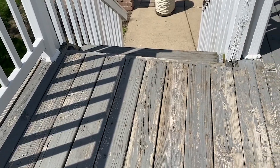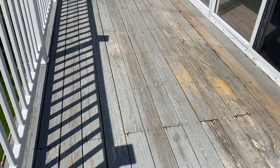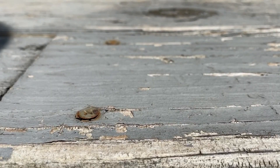The obvious is the overall appearance of your deck. If it has been previously stained, whether it was a semi-transparent or a solid colored stain, you'll notice some variances in the color or the coverage. Typically, solid colored stains will show peeling, where you'll see bare wood underneath the finish. With semi-transparent colored stains, you'll definitely see fading.